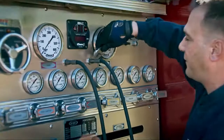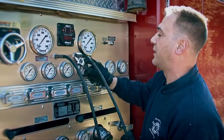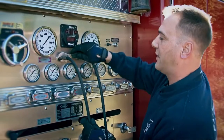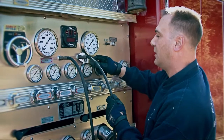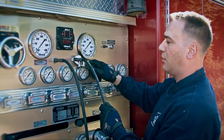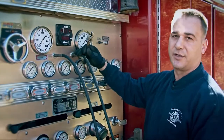One of the things with the test gauges — we've found that if you do not tighten these down, when you go to pull your prime, this is one of the areas you could actually lose some of the truck's vacuum, and it could be one of your problems when doing your pump test. So make sure you tighten these down just snug — you don't want to wrench them too hard so you don't strip them out, but you want a good solid seal so when you pull your vacuum, you don't lose any of the truck's pump vacuum.